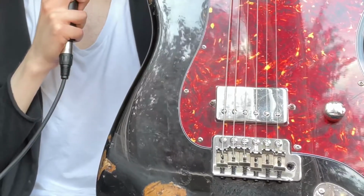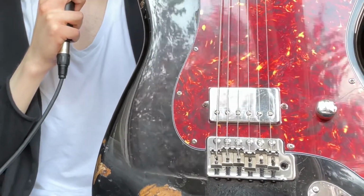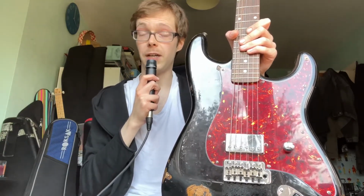A microphone works by having a diaphragm that's made of metal, and when the audio hits the diaphragm, or your voice or guitar amp, whatever you're feeding into it, then it vibrates and that induces a current. What's happening here is when I yell into the pickup, something in the pickup is loose. It's either the metal cover or some of the coil windings are loose, and they're reacting to the noise that I'm sending in there, and it's coming through the amplifier. If you're at high volumes with a lot of gain, you will not only hear it, but it could in fact feed back into the pickup, which is feeding back into the amp, etc., and you get that horrible squealy noise.